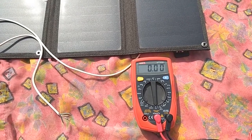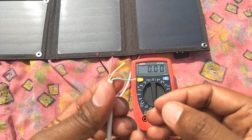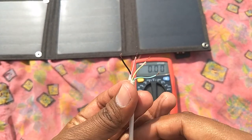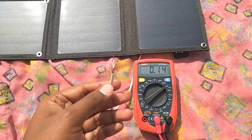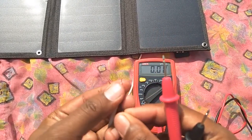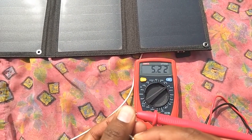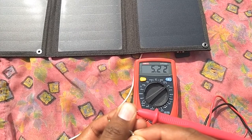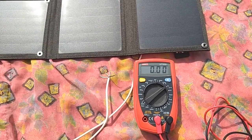I've set up a little test for this solar panel. I've connected a broken USB cable to the solar panel — there are four wires, of which one is red (positive) and one is black (negative). Let's turn the multimeter to the 20 volt setting and measure the voltage. Connect the red of the solar panel to the red of the multimeter and black to black. The screen is showing 5.2 volts, so the solar panel is producing 5.2 volts.